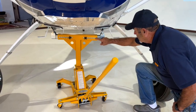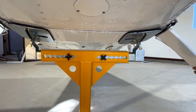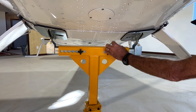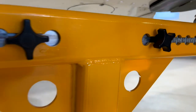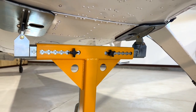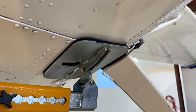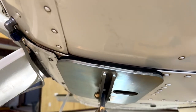The slide tubes here — these indents are really for when you're lifting up the flat gear option, which I'll show you in another video. These set screws don't have to go into one of those holes when you're using the belly pad, but for flat gear you really want to embed that into one of these holes so it will not slide in or out using the other type of lift option. It's just another safety item. The jack is fully articulating, so it'll go wherever it needs to, to fully conform to the bottom of the belly automatically as you lift it up — you just have to have it within reason. And the plates themselves are curved to mimic the belly curvature.